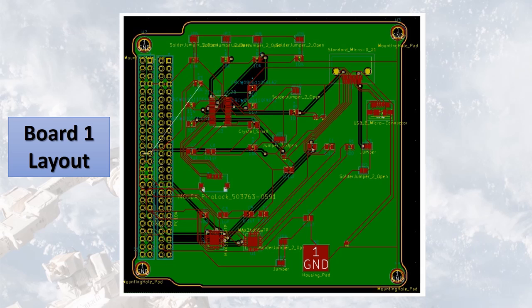The green shading, which covers most of the board, illustrates the grounding plane, which is essentially just a large single grounding point for all the devices. It's needed to shield against electromagnetic interference, which potentially distorts signals carried by copper traces. The holes located on each corner of the board allow physical mounting onto a chassis with the CubeSat and are plated for an extra ground connection.